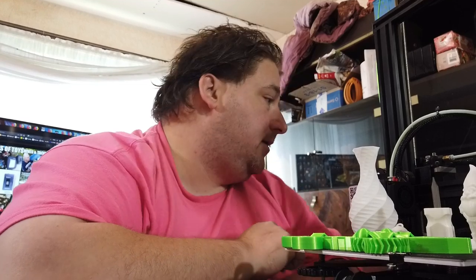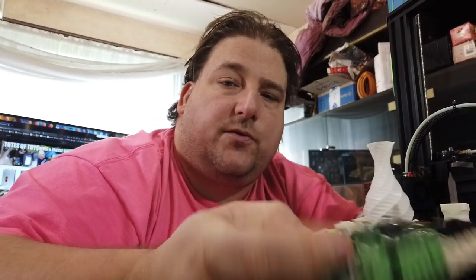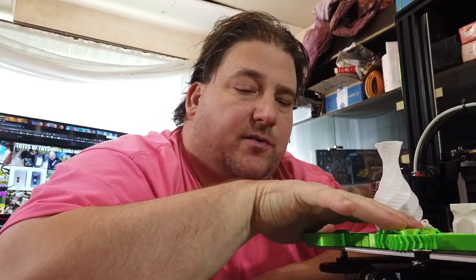It's done. Replacing the motherboard fixed it — got rid of the bad board. Two of the drivers were bad on it, and that works fine now. His screen is in better condition than my screen. My screen has a line in it that makes it hard to read the bed temperature, so I'm leaving the other screen on there. The top left-hand quadrant is inverted — a different color — but it's still readable so I'm leaving it.